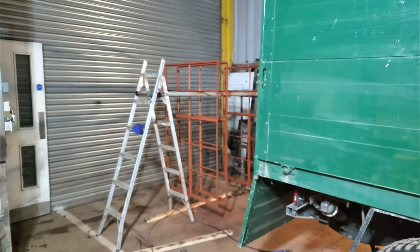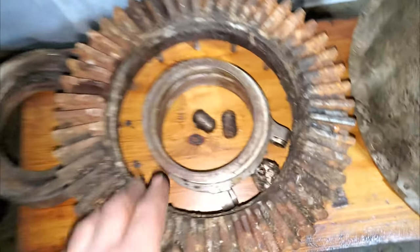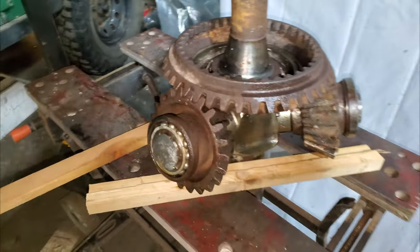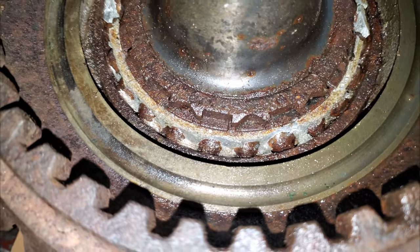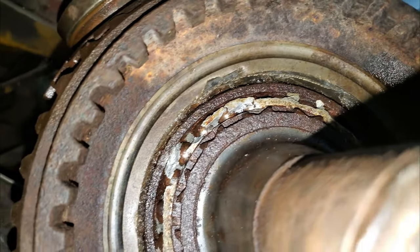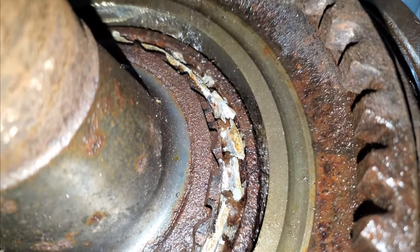So now I've finished twatting about with windows. Come back to this. So, with the bearing in there freed off, the oiling sleeve and bush removed, fixed gear removed, and now that all these rotate, it leaves one bearing, this one, which, as you can see, doesn't look happy. The aluminium ring that holds the ball bearing seems to be in a bit of pain there.